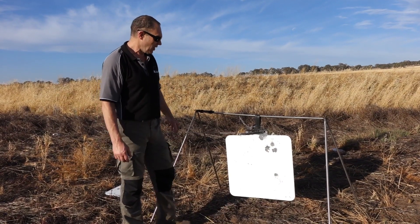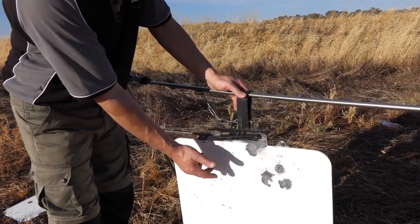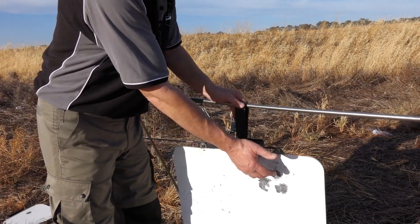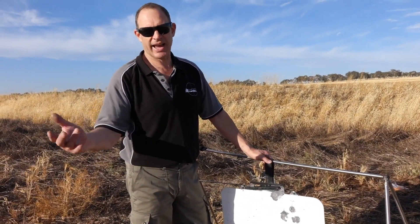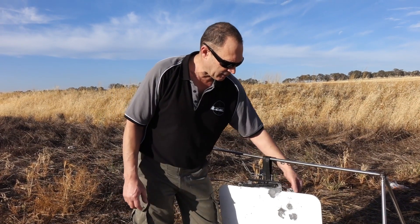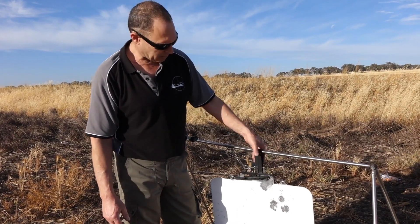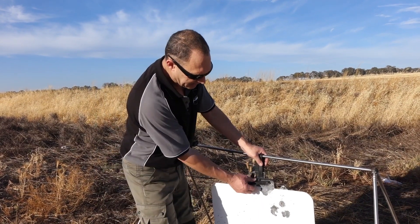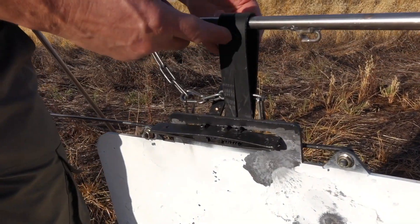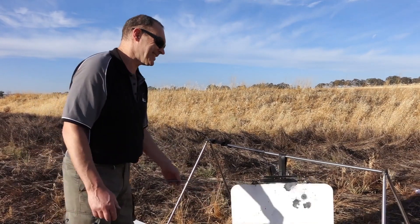For this one, I've got one of my normal heavy steel targets — a 6mm steel target, or quarter inch, in hard-ox 450, which is in the AR500 range for hardness. That's the steel target normally made to hang on these plates via the chains on these hooks. What I did was get a bit of serpentine belt — multi-groove belt — and sandwich it through a piece of steel that goes through the handle. Really all I'm doing is attaching a couple of pieces of serpentine belt to the center, which lets the target rotate.